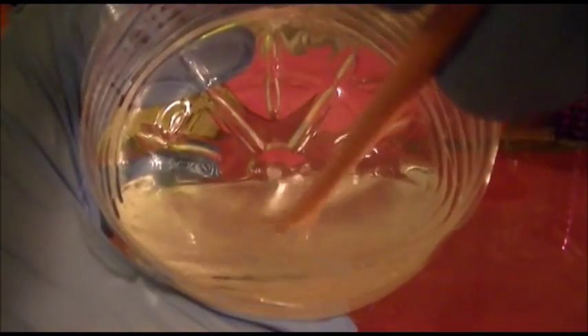Now that I have the exact same amount of both resin and hardener in my bottle, you can see it is really super clear — it almost looks like water. As I start to stir it, you'll see little lines appear and it starts to become foggy. You are going to stir slowly until your resin is all the way clear again. Once it's clear, you know you've mixed it thoroughly. If you don't mix it thoroughly, you run the risk of it being sticky once fully cured. Let's stir until it's clear.